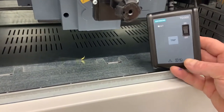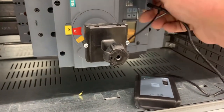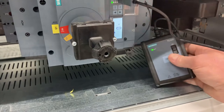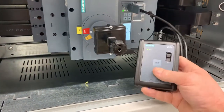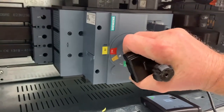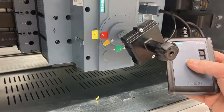Once we're happy we've got the right unit, we conduct the first test to make sure the actual breaker trips. As these units aren't powered externally from an auxiliary supply, we have to use a little handheld battery unit that has a trip function on it. We select the breaker to ON, make sure it trips. Then we take it to the reset position and all the way back to ON again to make sure the breaker resets OK, and trip it again. Happy with that.